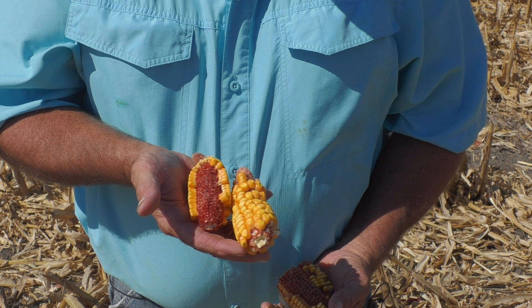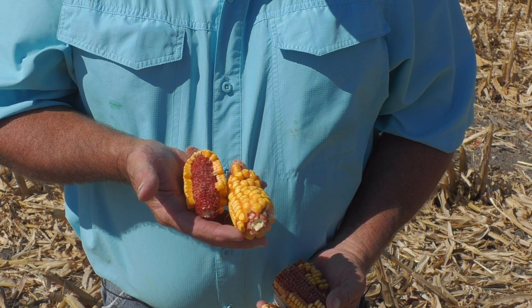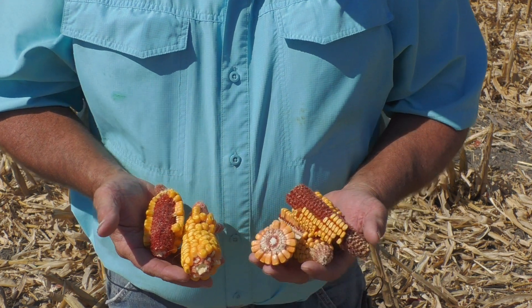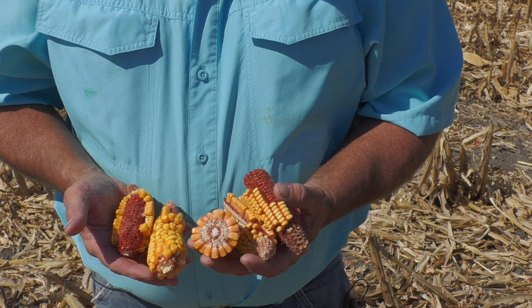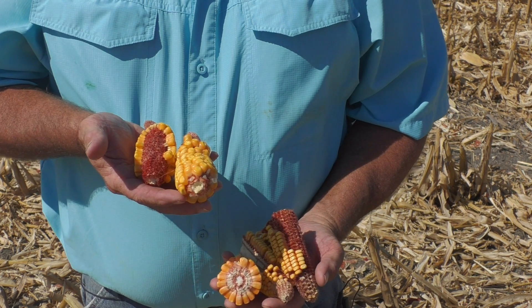Ears like this are going to be coming through the deck plates. So it's going to be how far apart you have your stripper plate set and how fast the head speed's running. This is going to be your threshing or your cylinder loss, as far as how tight things are. We've got to tighten this up to get this grain cleaned up.